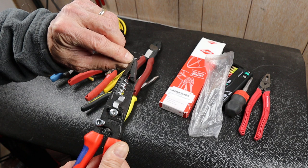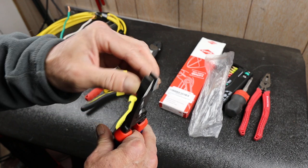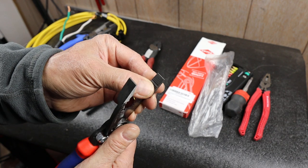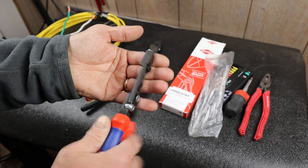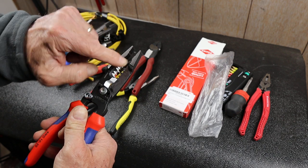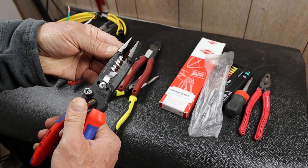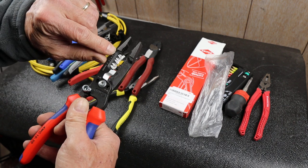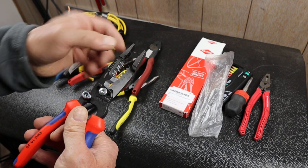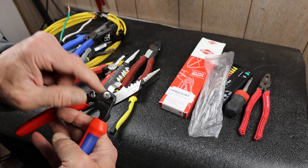What do we have? We've got the lineman or grabbing jaws, a little bit of a duck bill going on here. This is a wire bending hole — you can just quickly grab a wire and it seats in there. Notice it's smooth, so it's not going to score up the wire, and that allows you to do some twisting, say for outlet work. Another grabbing jaw, then there's a spot for bolts or nuts — a little bit larger — which grabs kind of round things. Then it goes through the different sizes of both solid and stranded wire. You can see it's got these indexing points that allow you to quickly drop in 12, 10, 18, or 14 gauge wire. Down here it's got a pretty impressive cutter.